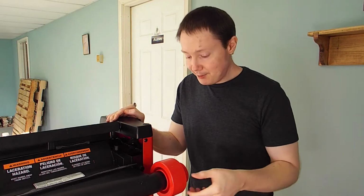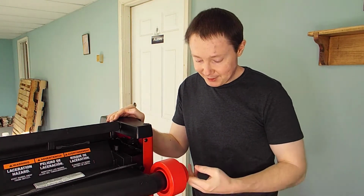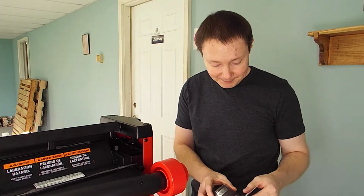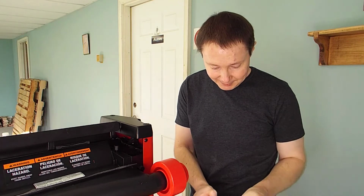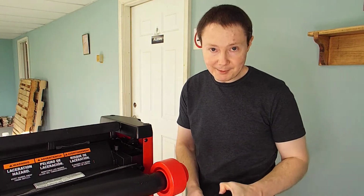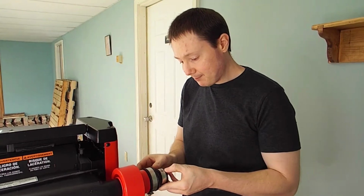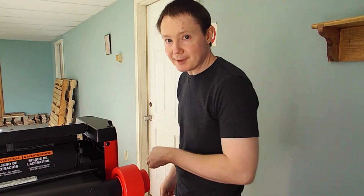Now we do dust collection with the shop vac, which is a 1.5 inch hose, and it won't fit any of this. So if you'll notice on our table saw and our miter saw, we have one of these little dudes. This is a plumbing fitting that connects a 2 inch hose to a 1.5 inch hose, which works with your shop vac. You can put this right on here and connect your shop vac hose right there. So all I need is a screwdriver to loosen that clamp and clamp it on.